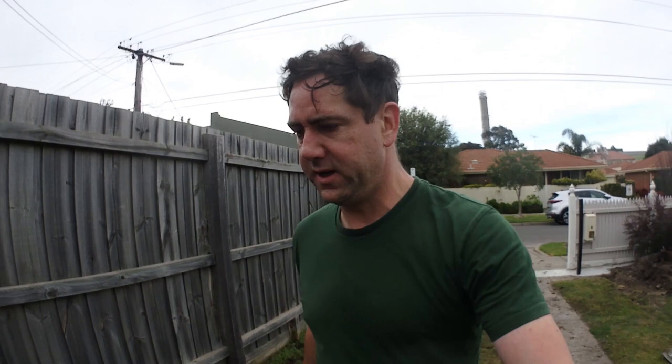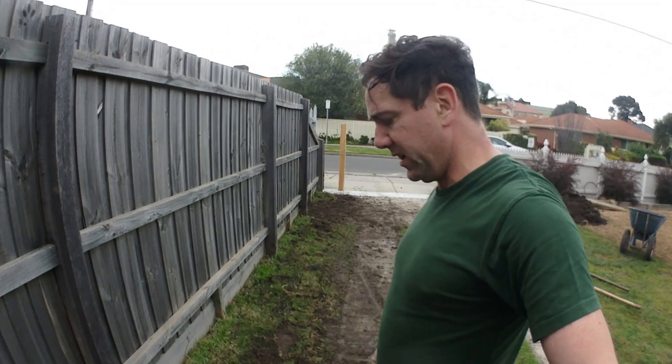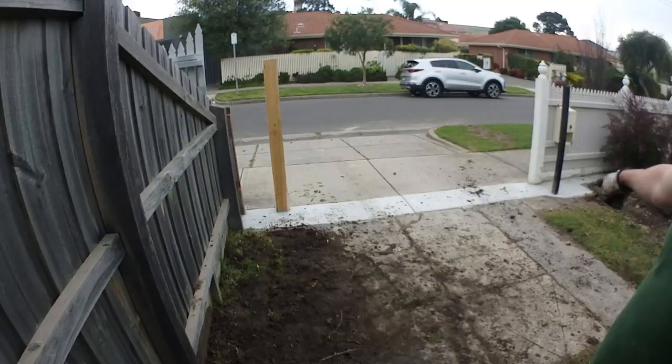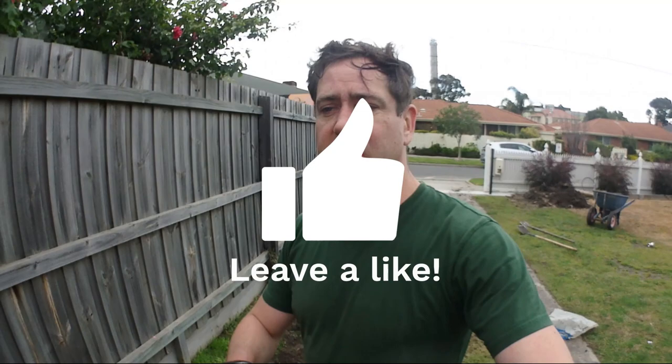All done! It's been about four days overall — dig the trench, put the aggregate in, lay the drain, cover it back up. Obviously the time was mostly in the trenching, cutting the concrete, trenching out to get the pipe to the street, laying the concrete, and then putting the drain in. Thank goodness we now no longer have standing water. That's all for this episode of Lawn Dreams — give us a like if you enjoyed it, hit that subscribe button if you want to keep it coming, and have a great day. Tight stripes, guys!